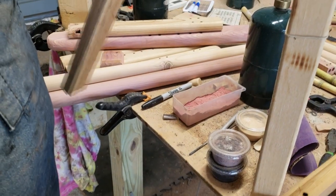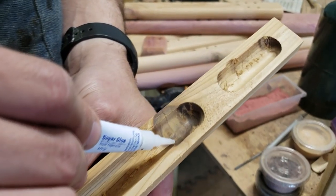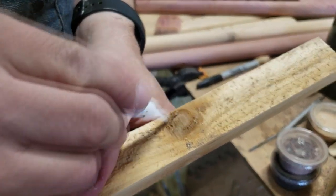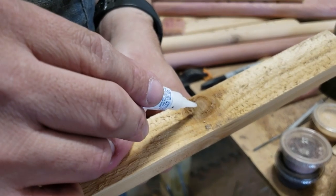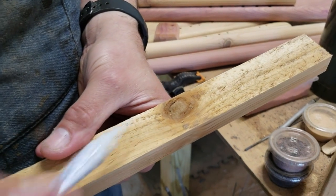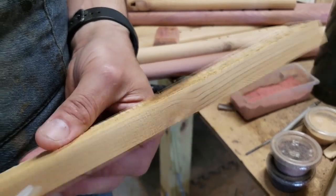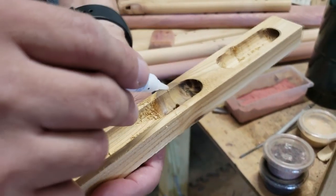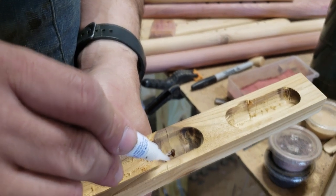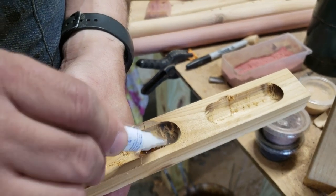Now here's the other half of this blank. I've just been sitting it there for a while in hopes of doing this repair, but this knot has some obvious cracks. This side here to the naked eye just looks like some rough looking wood, and I can tell that it's soft around the outside, which means at the life stage of this particular plant, that bit of wood there was starting to decompose — it would be doing that sometime in the next few years if left in its natural environment. The inside of the knot here has already started cracking. So I'm going to go ahead and put some of the super glue in it. This is a very liquid brand of super glue.